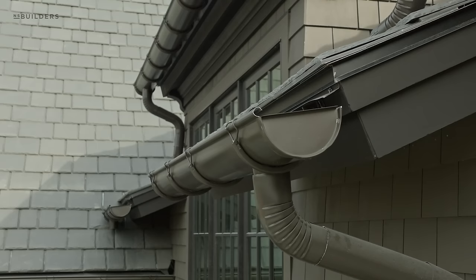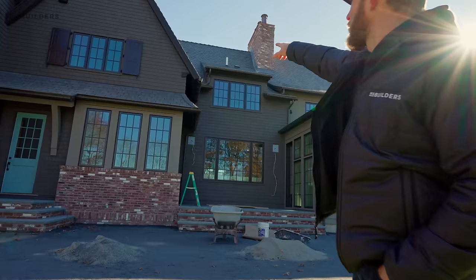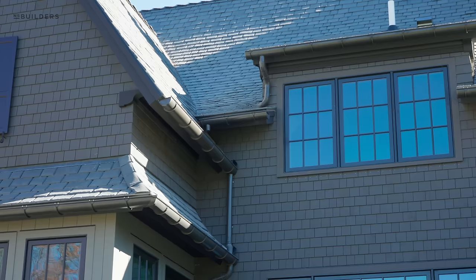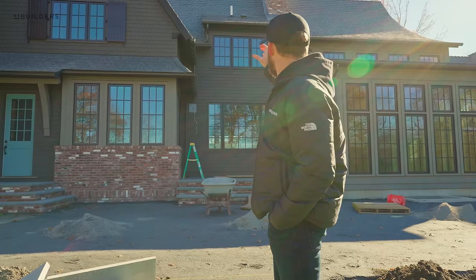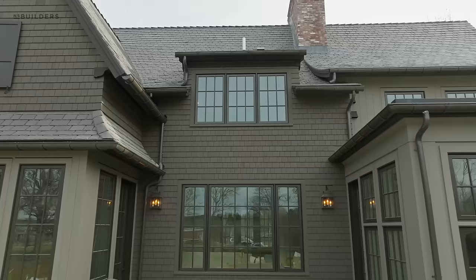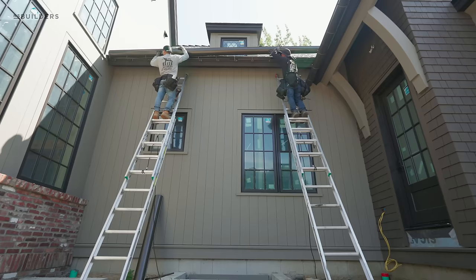As we work our way around you'll see a couple more shutters and some more views of the gutter. I wanted to point out specifically where that roof line is — you can see how that square cut rafter interacts with that half round gutter. The water is coming down and that bracket needs to be adjustable, because almost all of these roof lines are a little bit different. Having an adjustable half round roof bracket is really key to installing those at the necessary angle.